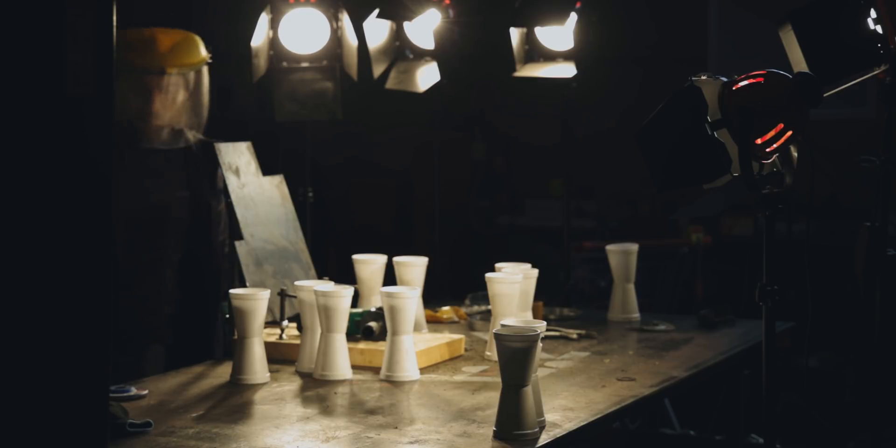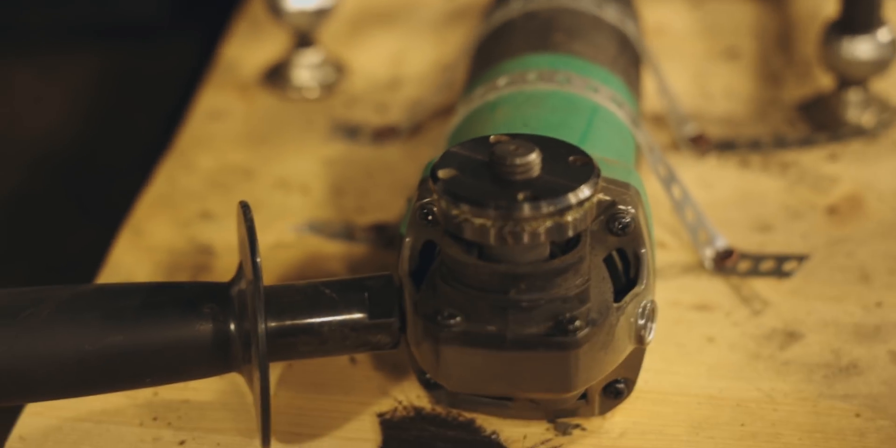It's obviously kind of self-locking because of the way it turns — it basically gets stuck in there, which is a feature they definitely thought about. But still, you want to lock it properly. For me it all boils down to at least two things: always use high-quality discs rated for the RPM of your machine, and don't use old discs or ones left out in the weather.